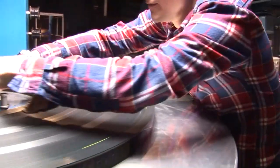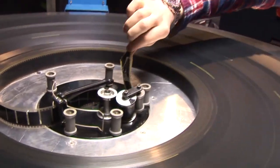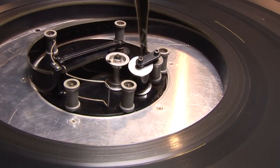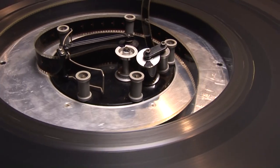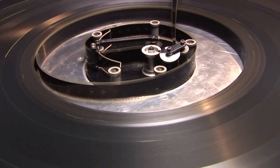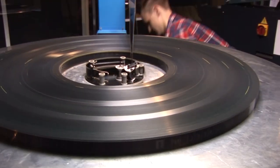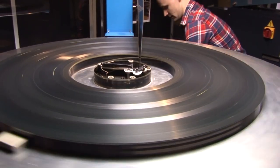And then you feed the film through. So if you watch what will happen here, when I pull the film, if I'm the motor on the projector, you'll see what happens. That arm moves and you see the plate move. So that's all it's doing. That governs. That's making sure the projector has a constant feed. So that's what that's doing, basically.